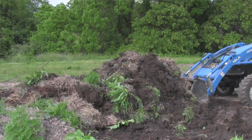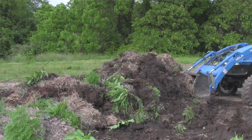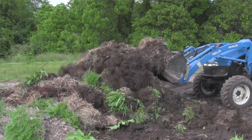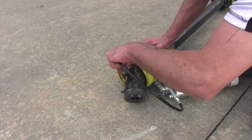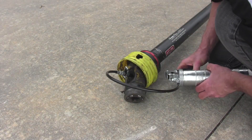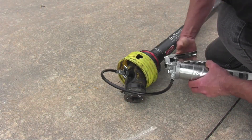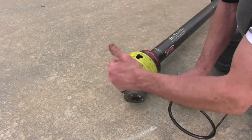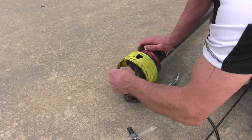Number six, not all grease fittings need to be greased at the same intervals. Certain grease fittings on a tractor you just touch maybe once a year, because they're not used that much. If you're using your loader a lot, you may want to grease it more than the recommended intervals. On your brush hog, your tiller, and anything with a PTO shaft, those U-joints in the PTO need grease often. I recommend doing it every time you use it, just to be safe. The more it spins and the more pressure it's under, the more often you need to grease it.